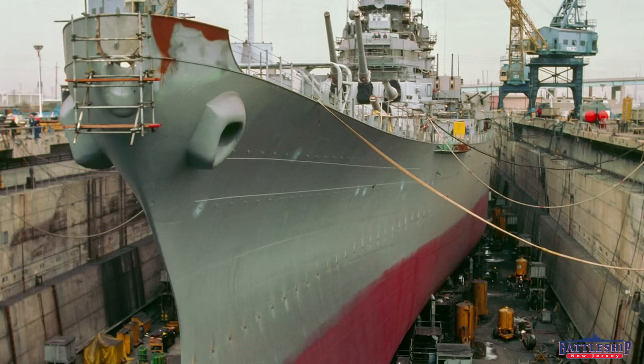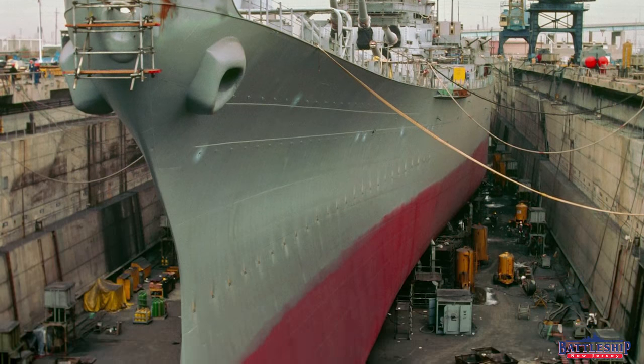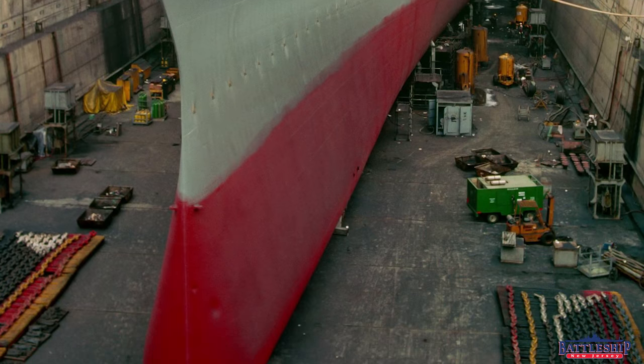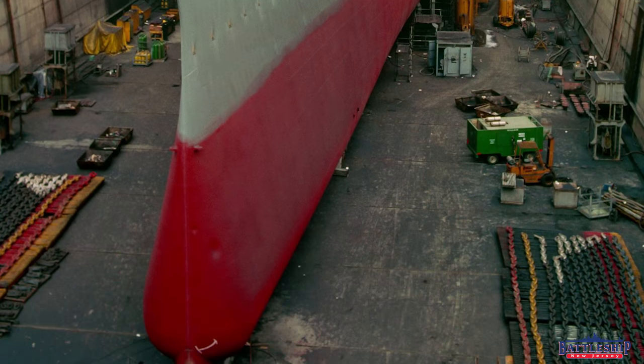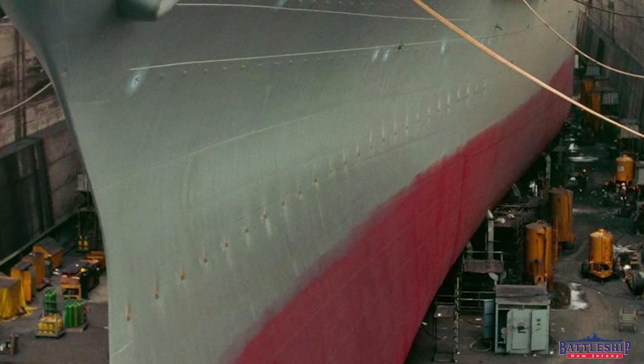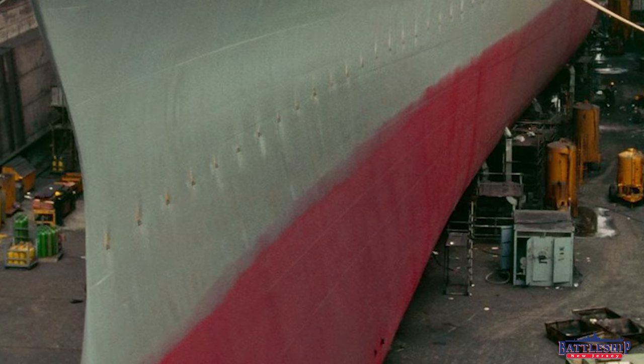That's anti-fouling paint. One of the early things they would have had to do is cut the blanks on all of the sea chests — those are openings in the bottom of the ship that allow feed water to go into the evaporators, the condensers, things like that. You just don't need that when the ship is mothballed, so you cover those over with steel plates. So they would have cut that open, painted the entire underside of the ship, first hydro-blasted or maybe sandblasted at this time period, back to white metal, got all the growth off, and then put the system of coatings down. She does not yet have that black boot-topping band that would go between the gray and the red, so it looks like she's got two coats of each — that's the next step, and at that point they can refloat the ship.